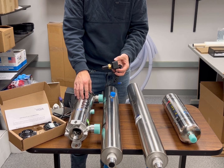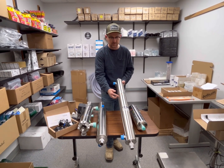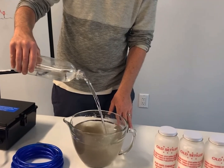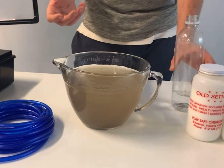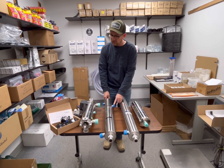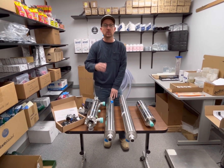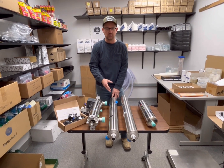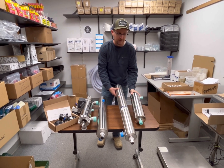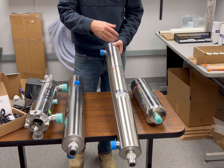This is the clarity sensor for the Viqua Pro 10. The Class B systems, or straight UV sterilizers, do not have that clarity sensor, which can actually be advantageous. In a lot of rain harvesting systems, the water can be murky — particularly after a rain event when water enters a cistern and stirs up sediment on the bottom of the tank. In those instances, the clarity sensor can trigger an alarm that can be a nuisance. Unless you really want to know that your water supply is clarified and the UV system is working optimally, we recommend not using the clarity sensor and going for a basic model like the Viqua D4 or the UV Dynamics UVD 600, which are great for household applications.